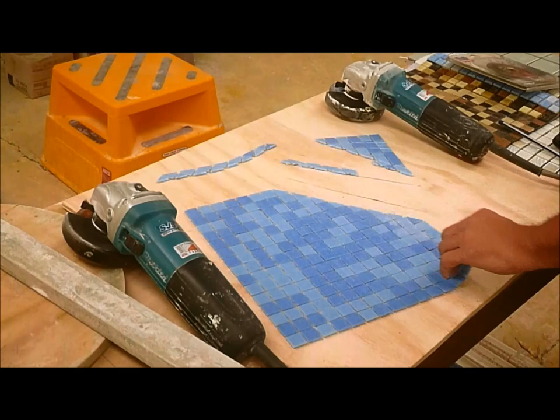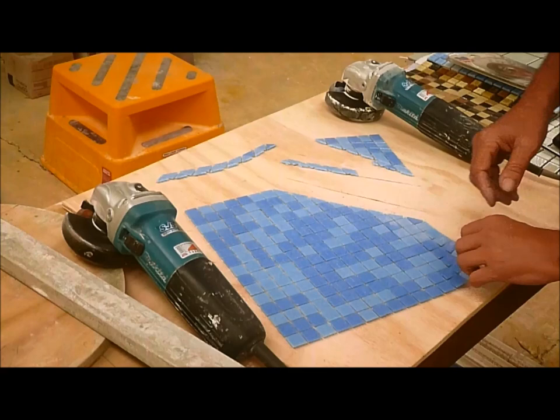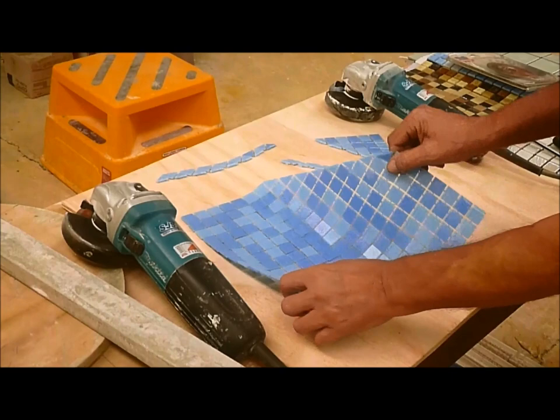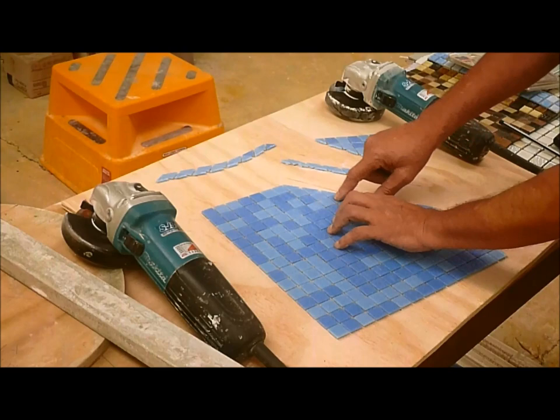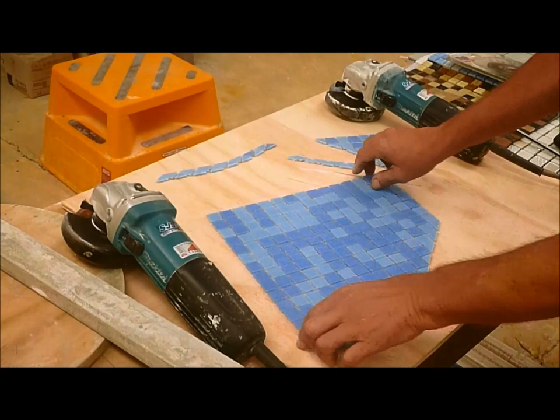I'm not blunting the blade on another tile or something else. I'll sit this on wood and occasionally we'll need to brush off - obviously don't do that with your hand because of the sharp glass. Eventually we'll have little bits of broken glass here, and if you try to position the tile you're going to cut with a piece of glass under it, you'll get all these nasty bits and pieces. So I've actually got a vacuum here ready to suck this up - keep yourself clean.